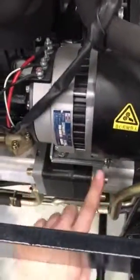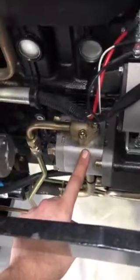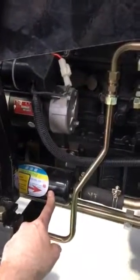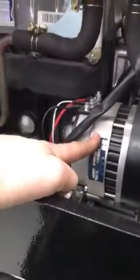Dual hydraulic pumps: a dedicated power steering pump with pressure relief valve, and a main hydraulic pump — 27 litres per minute. Suction intake filter for the hydraulics is a gauze cleanable element with internal magnets. You also have a starter motor and an alternator with internal regulator.